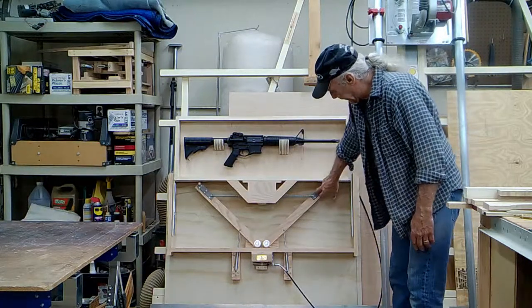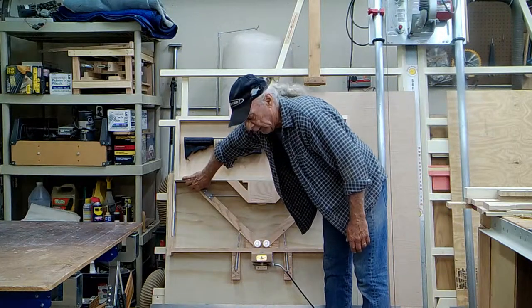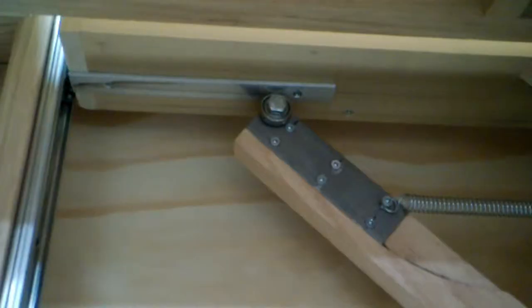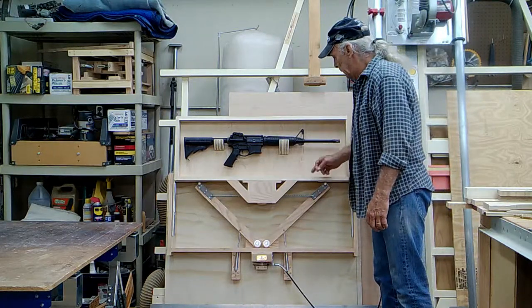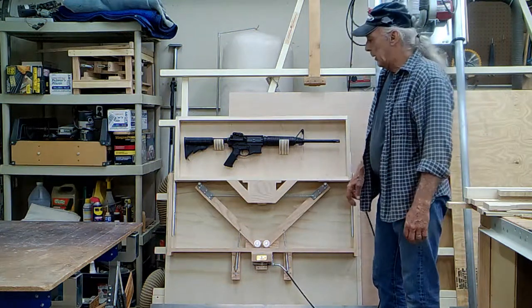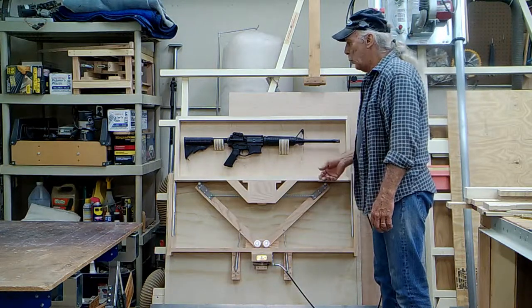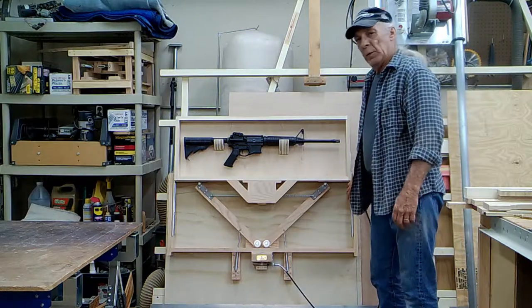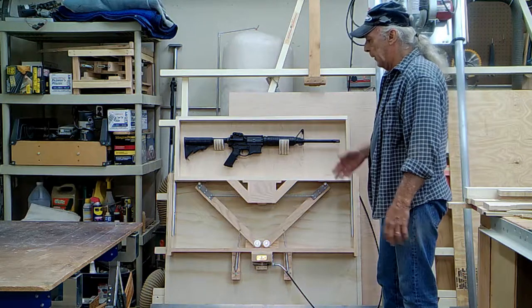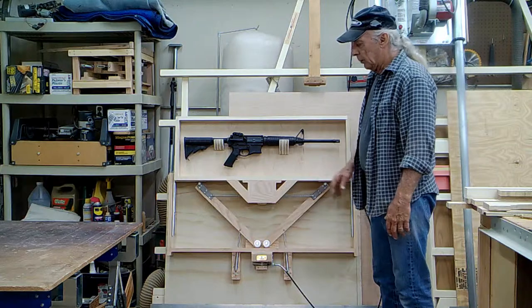The lifting points themselves — I've got a piece of one-eighth-inch flat iron, and then mounted to that are some small roller bearings, and they ride on some thin aluminum strips on the back side of the shelf so that the bearing is riding on metal instead of onto the wood itself. As far as what's controlling the tray, I've got full-extension drawer slides on the side, and they work nicely — they're smooth and gave me the amount of travel I needed to clear the tabletop of the eventual cabinet.